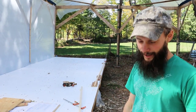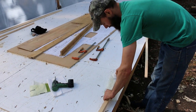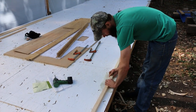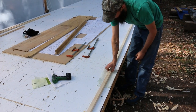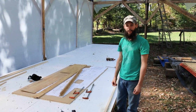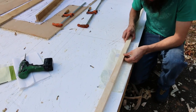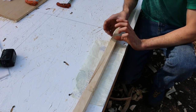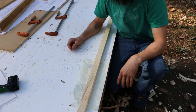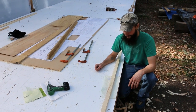Now we have all the scarves cut and we've got to glue them together. We'll put down some grain bags from the chicken feed to keep glue off the lofting floor. We'll put the pieces on their side and clamp them down to the lofting table and let them dry overnight. By cutting them oversized, if the joint slides a little it doesn't matter because we're going to bring this all down smaller through the thickness planer anyway. As long as it's a tight glue joint, we'll plane these down and everything will be nice and smooth. We do have to wrestle a 30-something foot batten through the planer though.